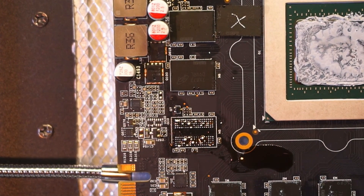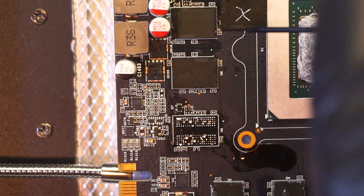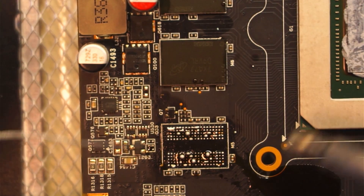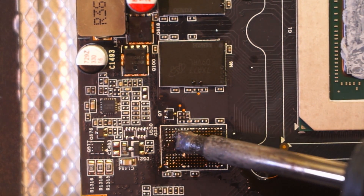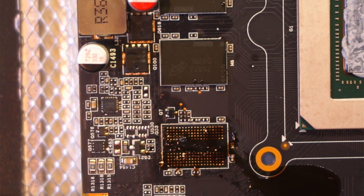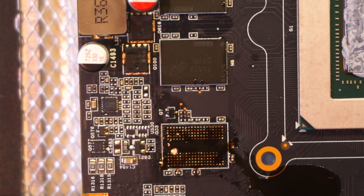I accidentally lost the chip while lifting it with my tweezers, but luckily it didn't bump into other components. Now I'm applying fresh leaded solder to the pads to lower the melting temperature, and then removing all the solder using the soldering braid. It's important to use as little pressure as possible to prevent damage to the pads and the PCB coating.